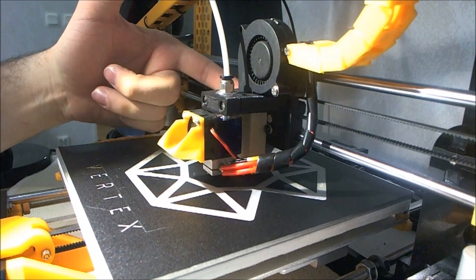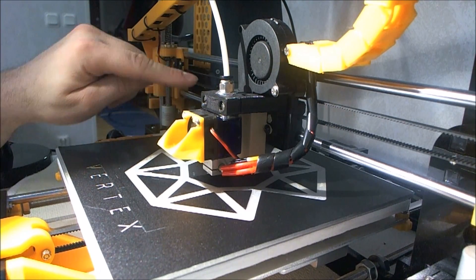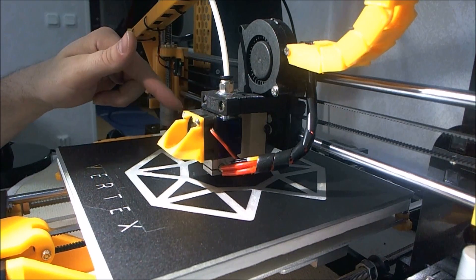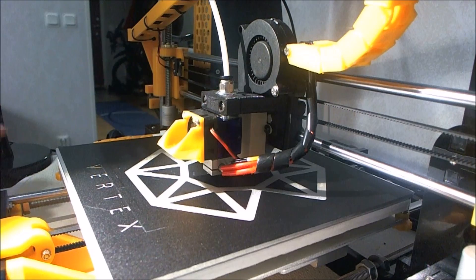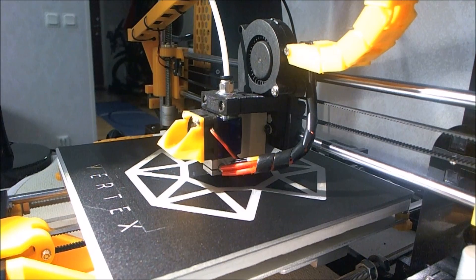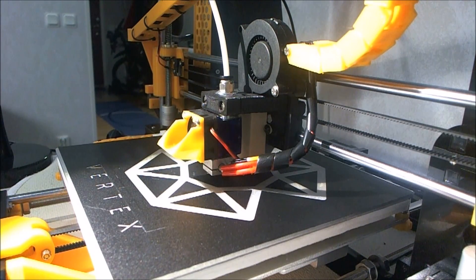If the center isn't the same as the four corners, it's probably not the bed — it's probably the rods being bent. A small trick: you can twist the rods like screws to level the nozzle height even if the rod is slightly bent. If it's too badly bent, take the rods out, place them on a mirror (which is perfectly flat), roll them to find which side is bent, then carefully bend them back on the opposite side. After leveling is done, go to the printer and press Home All.